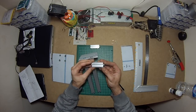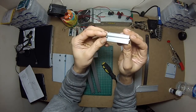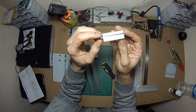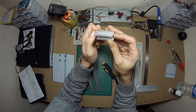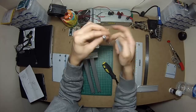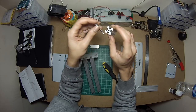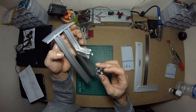There's a washer and a bolt on these side screws. You could get the exact right size screws and have the screw head sit flat. Or if you want it hidden so you can put a cap over it, just drill this hole out as wide as the screw head and only as deep as the head — then you'll be able to screw it all the way in until it's completely hidden. I'm just going to get them in place for now before I level it up.